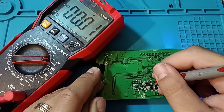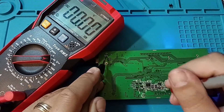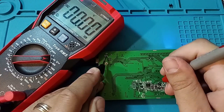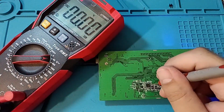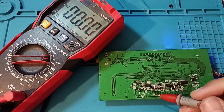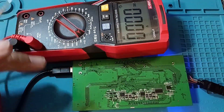This component is showing nothing, but here 5 volts, 5 volts, 5 volts. Around this chip we have electricity. But this chip doesn't have current at its supply pin — it can be from the PCB trace on this board or the chip itself. And this is another issue this board has, and this is also one reason why this thing doesn't work.